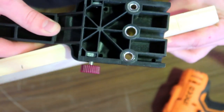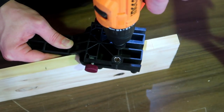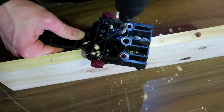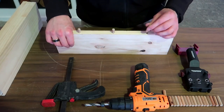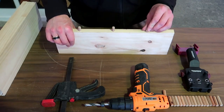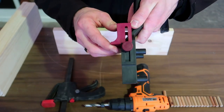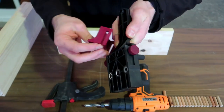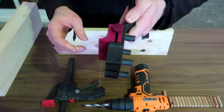Now that we have that set, we can start drilling our holes. Now that I've drilled my holes and got my dowels inserted — not glued yet — the next step is to attach the guide to the back of my joint mate. I'll loosen the knobs on both sides.